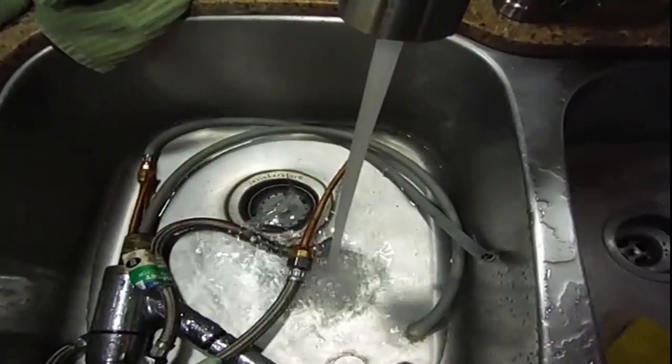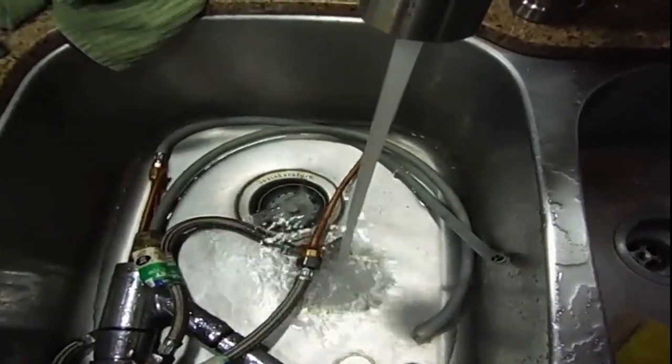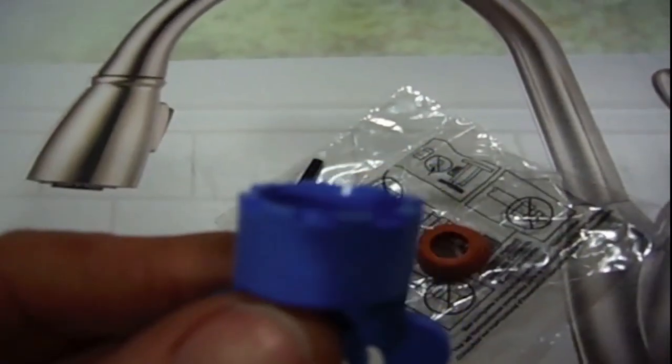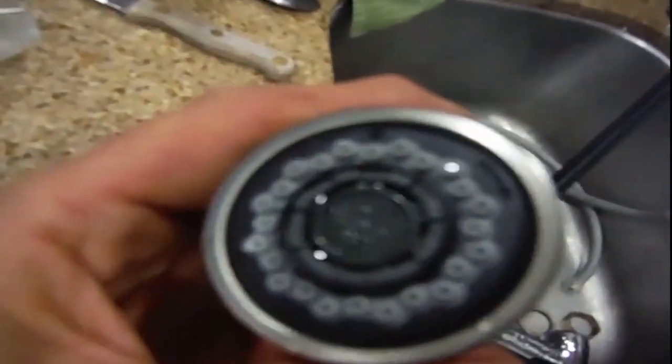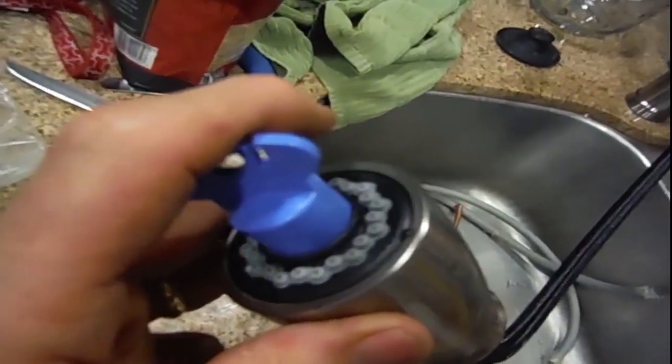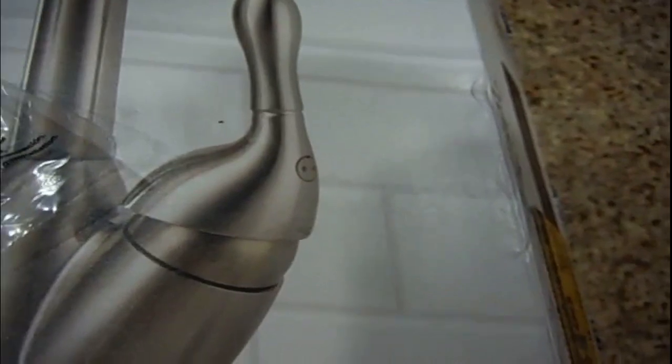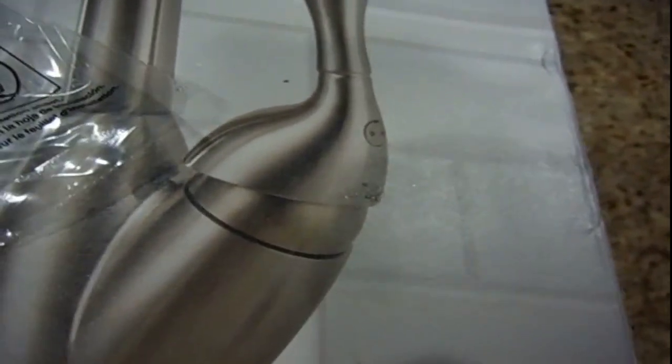I hope this helped you learn whether you want to put it in yourself or hire a handyman. The blue thing is a cartridge remover — it goes right on the edge and helps you remove the cartridge so you can always have a clean cartridge. The allen wrench lets you adjust the hot-cold balance. There's a thin plastic piece on the handle you can remove to adjust it. Factory settings are cold on cold and hot-cold on the hot side, to prevent children from getting burned.